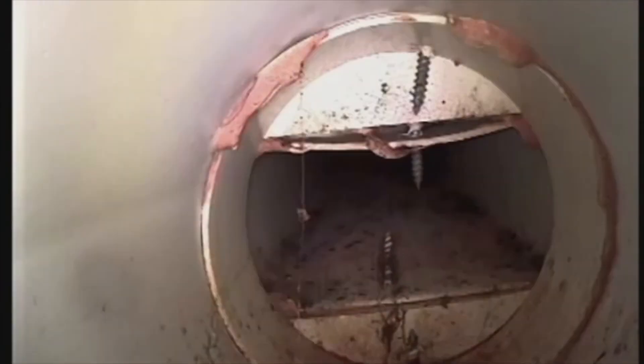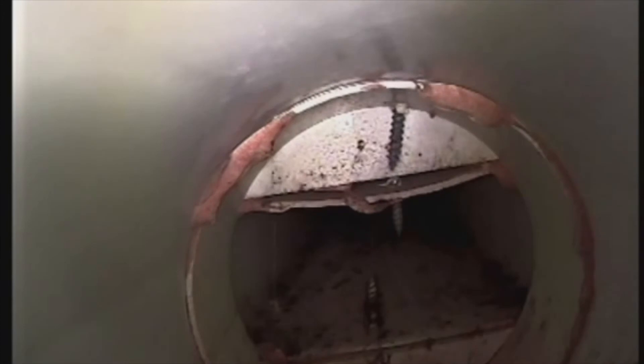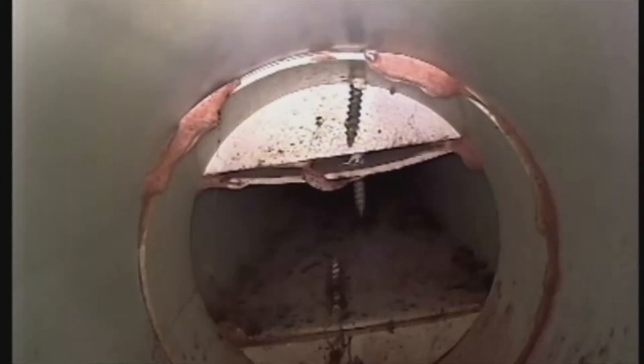What happens is warm moisture blows through the ducting, hits the external skin and forms condensation. That condensation can then run down the wall, make its way to the inner skin, and present a problem. It's not unusual with dirty wall ties or issues with the insulation.